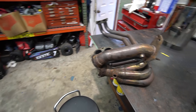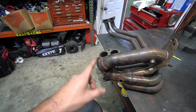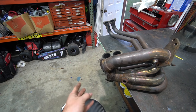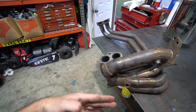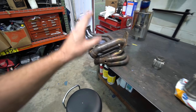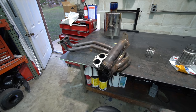I'm the only downfall here. It's a good thing because it should be a lot more responsive, but the downfall is basically the boost control might be turned up too high now in the mid-range and it might over-boost, because basically it was set at that level while there was a massive exhaust leak. But who knows? We'll find out once we get this back together and get it tuned and go take it for a rip at the end of this video. So before then, no need to speculate — let's fix it.